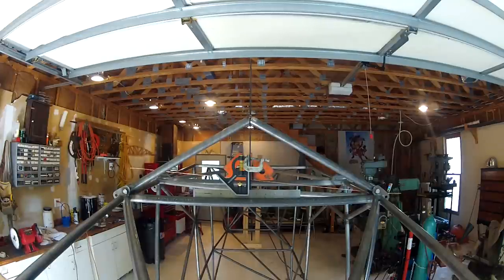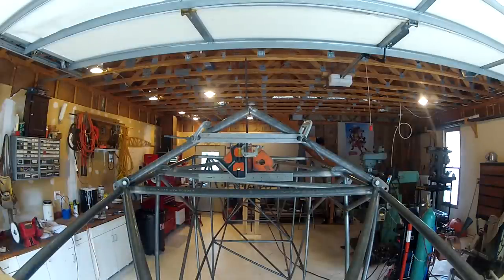That's exactly where I want it. I wish the fit up was a little bit better, but I can work with filling that, especially where I have that gusset plate that goes on there. So to facilitate moving this thing over to the welding table, I clamped that straight edge on there because my tack is not very good and I've got a lot to fill to make that work. And I don't want the relationship of it to change after it's finish welded. I want to make sure it still fits in the mount bracket. So it's fairly likely that this is going to walk a little bit. So I'm going to weld it together and then I'll refit it, make sure that everything fits before I completely finish weld it. So let me see if I can run a tack here across the top of this.